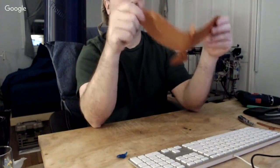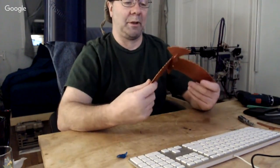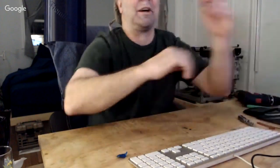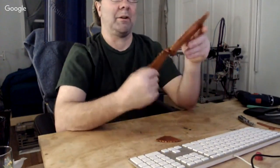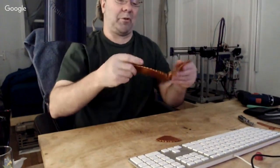There are a couple of guys who downloaded it today when I released the beta on Hawk 3D Proto's Twitch stream, and they want assembly instructions. This is a quick breakdown — you'll have to figure some of it out since this isn't 100% complete, but it should get the average person there. The biggest thing is: pre-clean, pre-build, pre-test before you glue anything together. Make sure the hinges work, make sure the body and wings flap very freely but not too freely — you don't want too much slop or they'll bind.